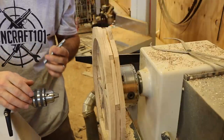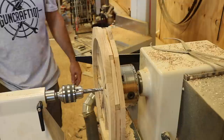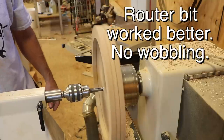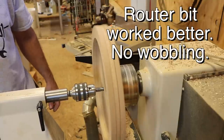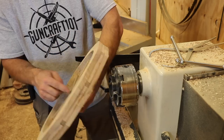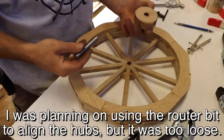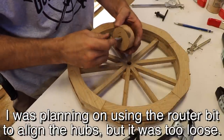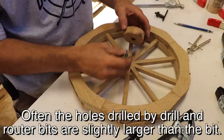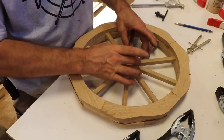This thing's wobbling a little bit as I drill it, so I am going to plunge with this half-inch router bit — that's going to be able to cut rather than getting pushed aside. So now I have a perfectly concentric hole all the way through, and then I can use that to align the other piece. I didn't use the bit that I cut the hole with because it was loose and wobbling. So on my metal lathe I turned that down, and it fits really snug and doesn't allow movement.